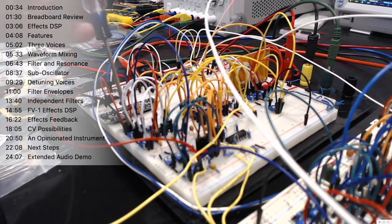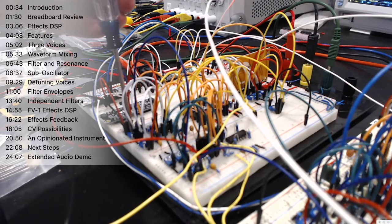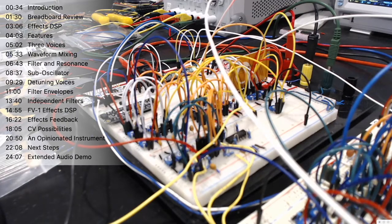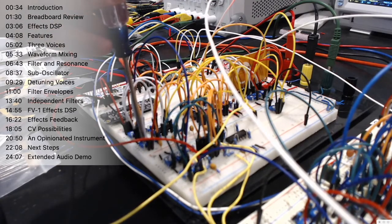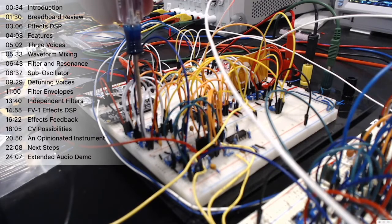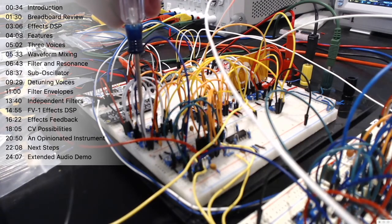The way I've wired it in is that there's a simple wet and dry here. And you can go pretty high on, you can actually add more gain to the signal coming back in. Another neat thing I added in though was the ability to feed back on the signal that's coming out of the reverb. So just dialing in very slowly here. Start to hear some more overtones coming in.